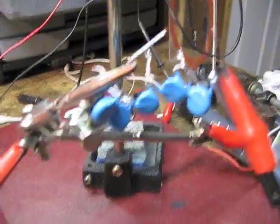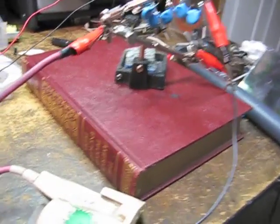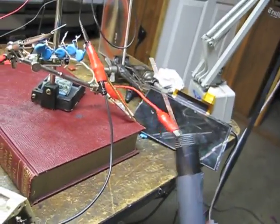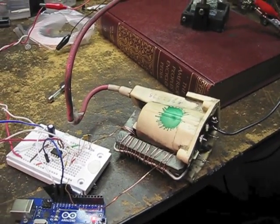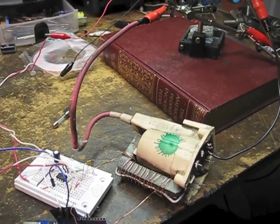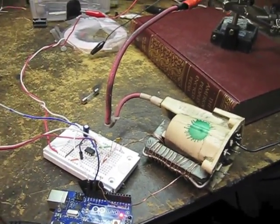I use everything on a stand. I have super shielded wires but still don't touch them, because at these high voltages regular insulators fail. That's why I have this wand right here. When you're working on this and you've got the flyback transformer running, use one hand — don't use two hands. It will make your risk of a shock through your heart a lot smaller.